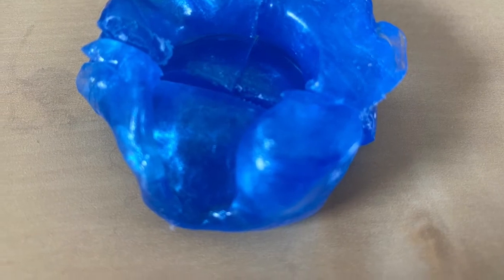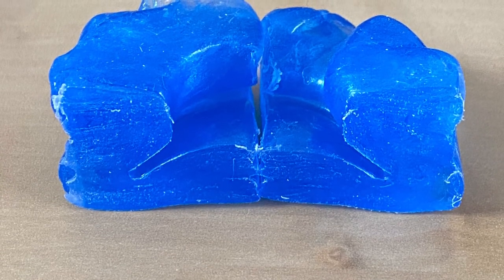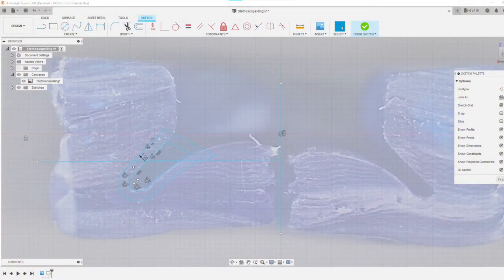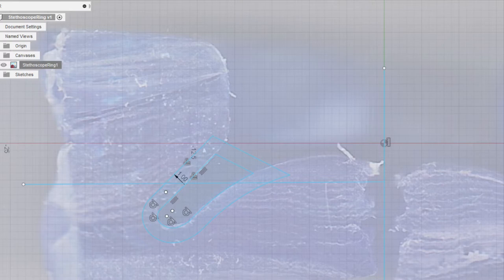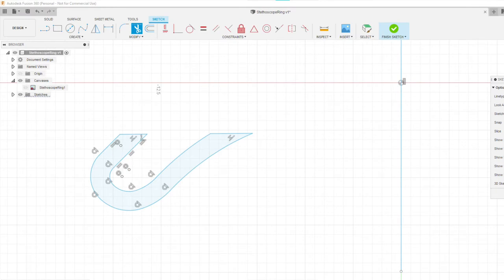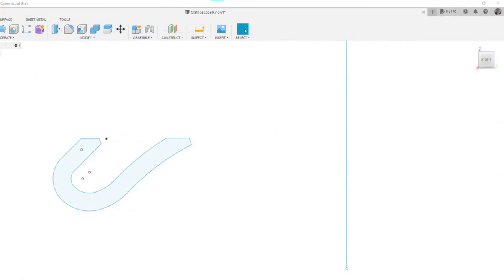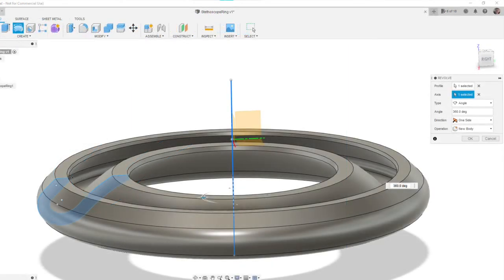Here are the pieces of the mould. I took one of them and cut it the other way with a much sharper knife. You can see there's a very clear profile now, which I was able to scan on my scanner and use as the canvas in the CAD modelling programme. We're now looking at Fusion 360 — you can see the canvas in the background and the sketch over the front of it. Once you've got the main lines lined up with the image you can turn the image off and carry on working on the sketch. I've taken the main line, put a one millimetre outline around it, trimmed it to have a flat top which will become a flat bottom, cut off the edges so it'll print nicely, and then revolved it around the centre axis to give the ring profile.